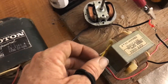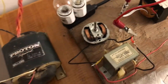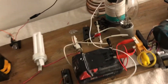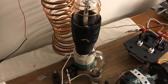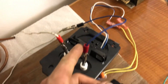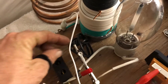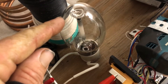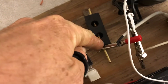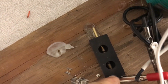These are connected together, which will make a loop with the little motor. The other thing I really have to show is the high pressure sodium setup — it's a dual high pressure sodium. So from the transformer, it goes into the high pressure sodium, up and back down, out of the high pressure sodium and into this high pressure sodium, out and into the spark gap — the double spark gap — which is connected to nothing.